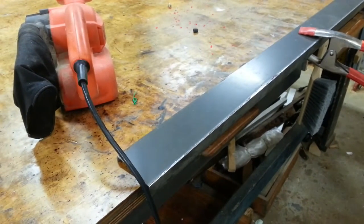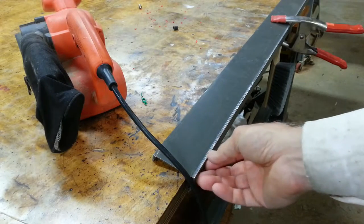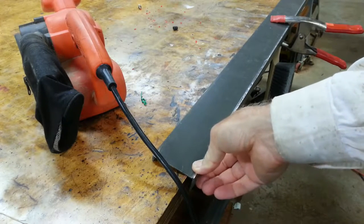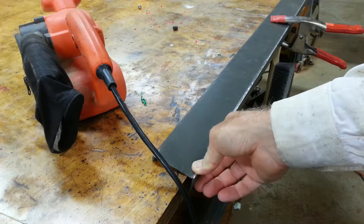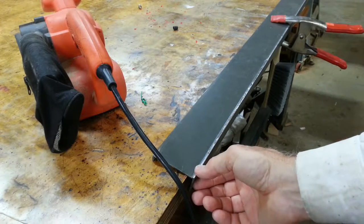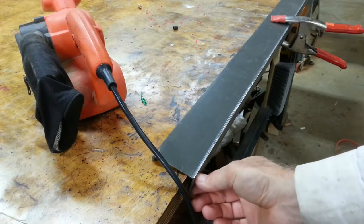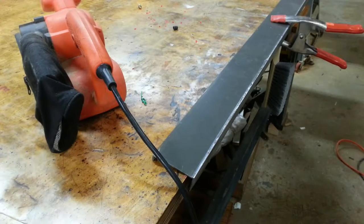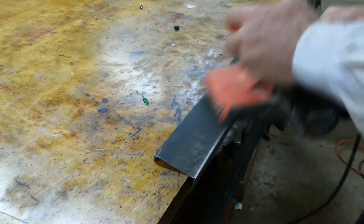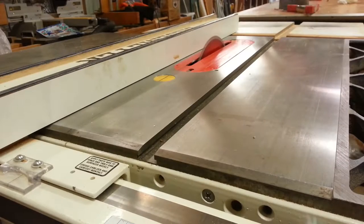Now it's time to take this aluminum piece and sand it flush where we cut. One of the cuts is sticking out quite a bit, and I did decide I have to cut the other side of it. I was thinking I could leave it at full width, but many times when you try to take a shortcut later in a project, you're not thinking through everything you'd planned originally. One reason it had to be narrow was to allow me to remove the pulley — this can only stick in about a half an inch. So I will have to cut that down.